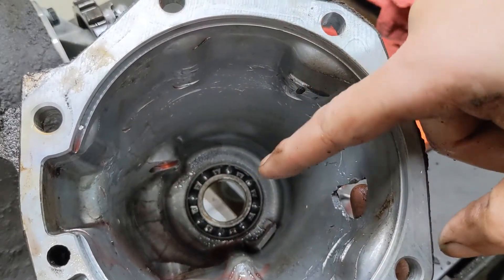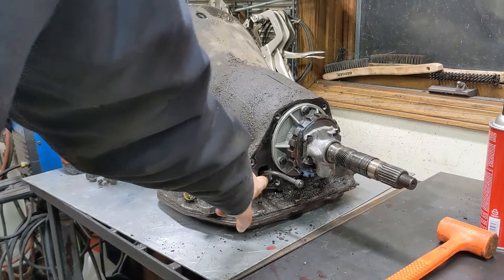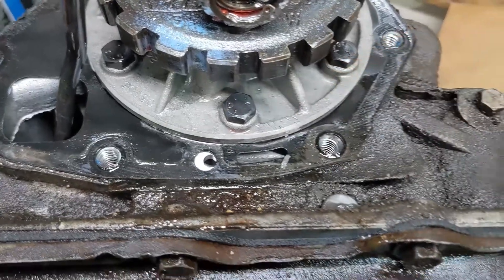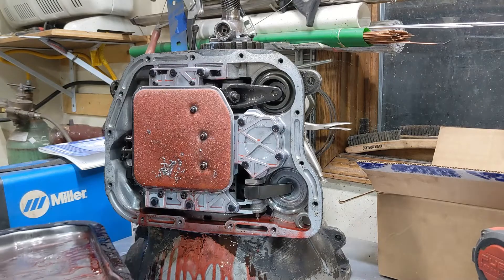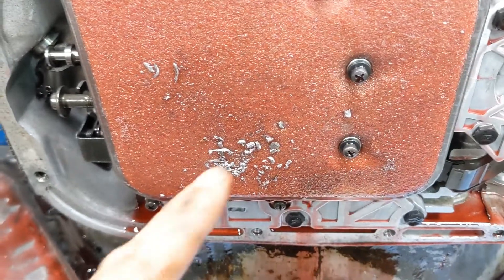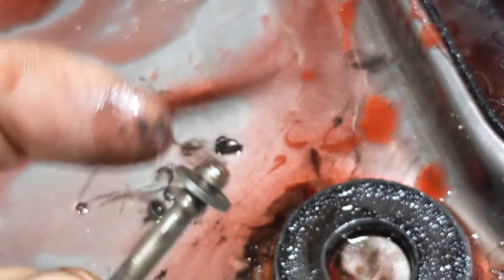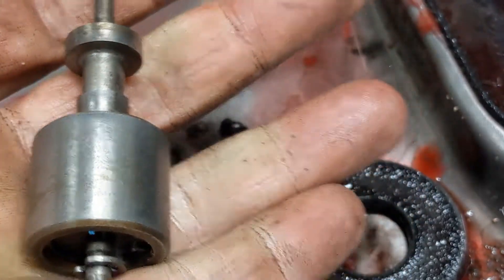That bearing you can't get factory new anymore — it has to be manufactured. So let's continue disassembly and see if anything may have gotten in through here. Check the condition of the clutches, that type of thing. It definitely looks like it was trying to ingest stuff. It definitely got a lot of pieces in there. Filter did its job though. There's an E-clip and here's a little steel nub — so it's this E-clip and the tip off of this rod. I think what probably happened is this rod just failed, came apart, and once that happened everything went sideways.